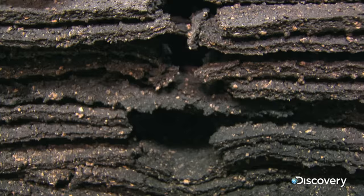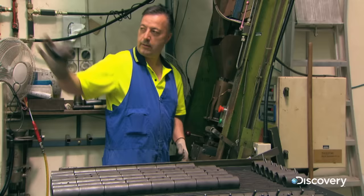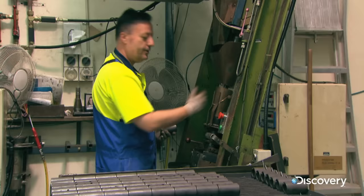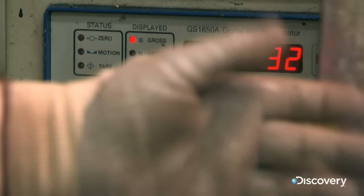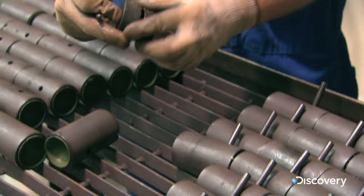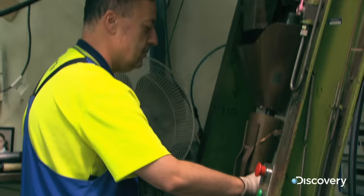The process starts with a core made from cork, the treated bark of a Portuguese oak tree. It's granulated cork which comes in sheets, travels up into the hoppers above me, falls through into a scale, and it weighs out each amount that I need. I'm putting in the bottom half of the core and when I push a button you'll see it come down and fill it, then the top half goes in and the machine compacts it together.